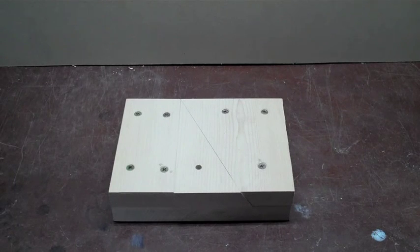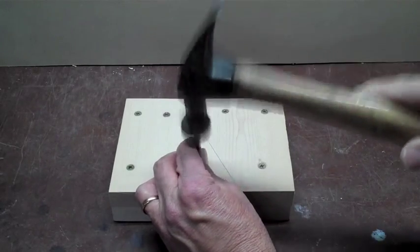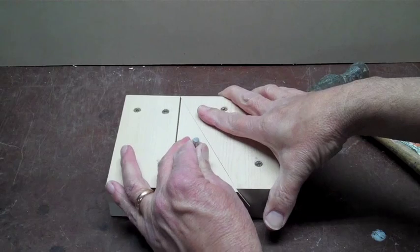When you're putting screws into maple, make sure you're generous with the pilot holes in size. Now I'm going to take and tap my metal rod into this quarter inch hole, and you can see now I have a sliding surface.